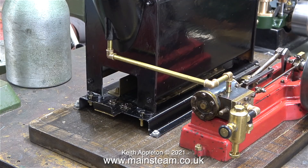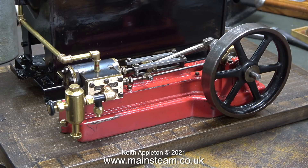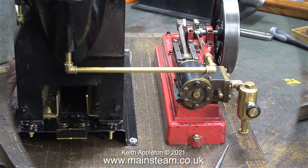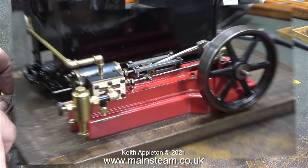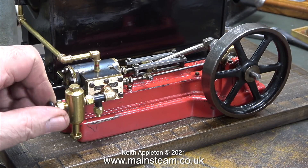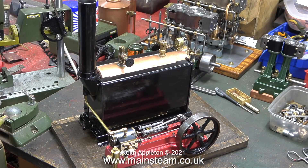You can clearly see the rest of the piping and it looks quite neat. I haven't yet screwed the vertical pipe into the cast elbow, but it looks okay. The exhaust steam going up the chimney via this pipe is going to be at a much lower temperature than the main steam inlet pipe, and for that reason the steam inlet pipe is going to run very close to the baseboard. I'll make the steam inlet piping and the adapter to fit it to the tap in the next episode.